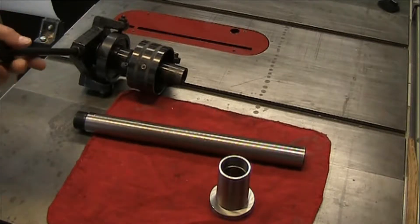Hey everybody, welcome back to the shop. If it's your first time here, my name is Doug. Today we've got an interesting project — a modification of my Grizzly 4003 gunsmithing lathe to add a collet closer. It's not offered as an option through Grizzly unfortunately, so I ended up buying their optional collet closer for another lathe and made some modifications. We'll walk through that in case you want to give it a try on your own lathe.